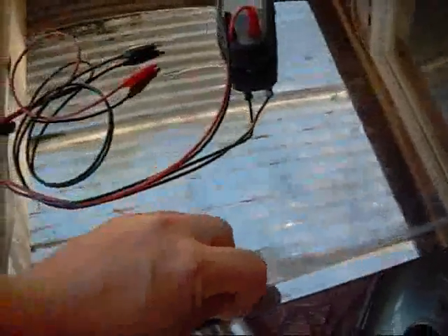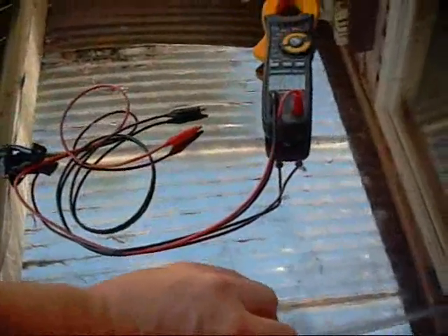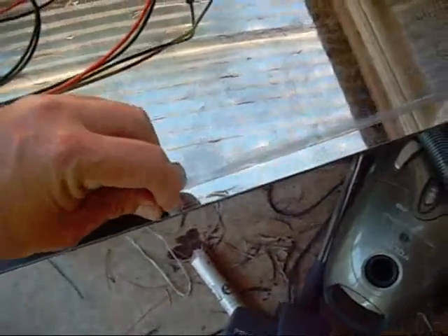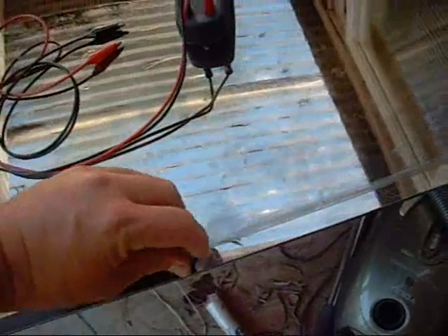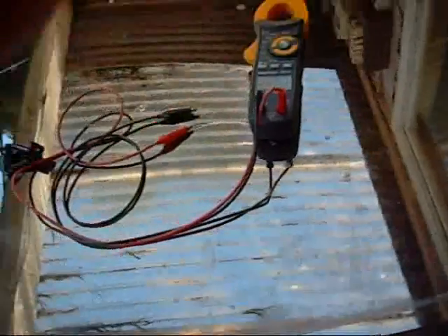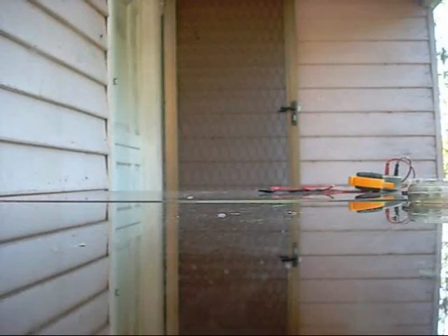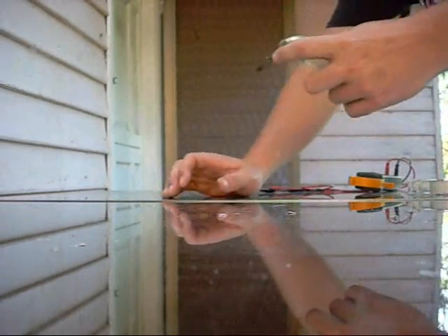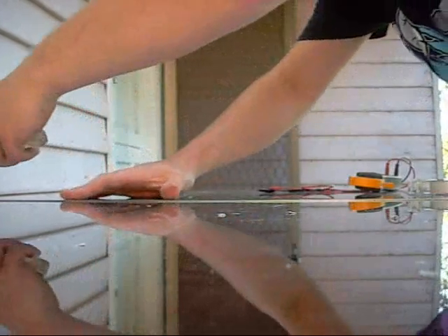It's nice and warm. Apparently the temperature will affect the cutting of the glass. So I'll just get all this plastic and rubbish off it, score it, and hopefully it'll snap. I'm told I only get one go at this, so here we go.